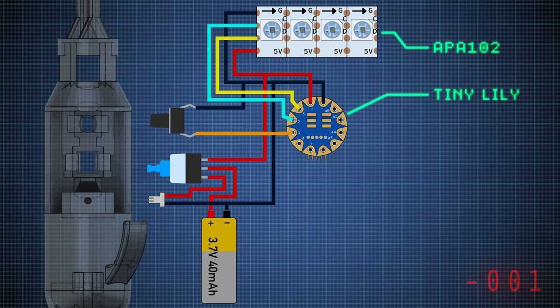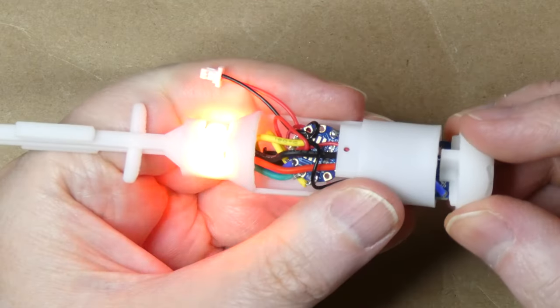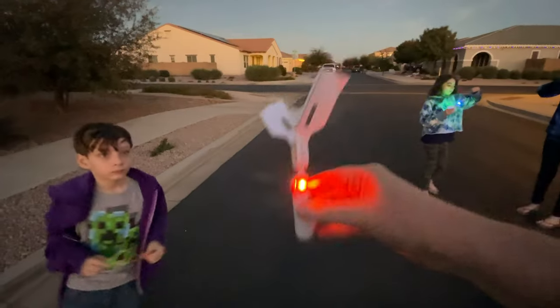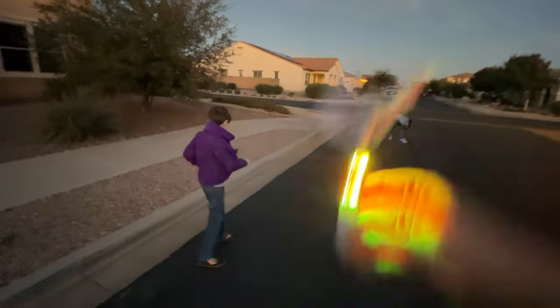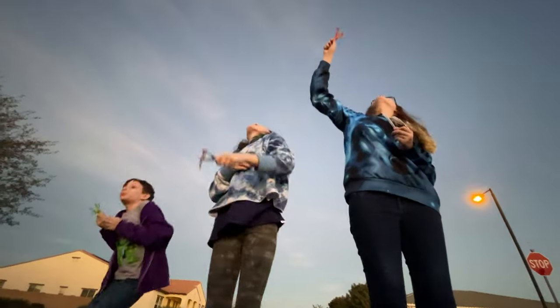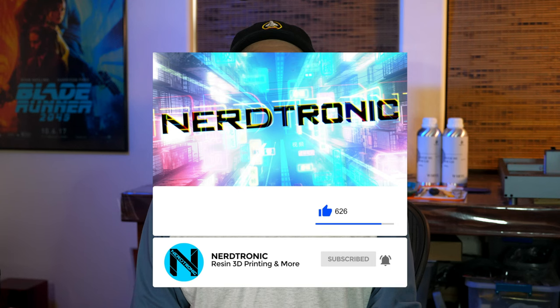I have one more modification I want to make: if I add an accelerometer in here, I can have the LED change color based on the acceleration of the rocket. The accelerometer is held in place by the nose cone, keeping it in line with the forward movement of the rocket. That's the extra mode I was talking about — the rocket exhaust acceleration mode, where heat or brightness is tied to movement, or more accurately to acceleration or changes in speed, so it should look sort of like a real rocket engine. I also made another mode that uses the acceleration data to change the hue. Thanks for watching — if you like this video please subscribe, hit the bell icon, and hit that like button.